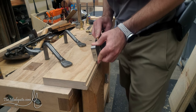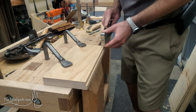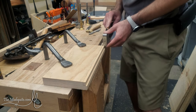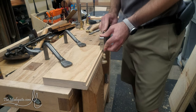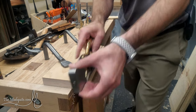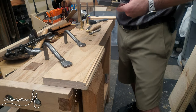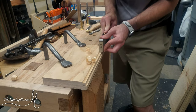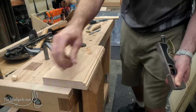Once again you can see starting on the very corner of the shoulder plane. The way my left hand is positioned, I'm basically pinching the plane so my fingers run against the workpiece to act as a fence, helping it stay on track. Otherwise you may end up accidentally skating off, and obviously that wouldn't be ideal. So you just keep planing until you hit your lines.